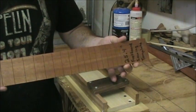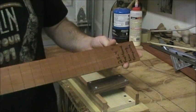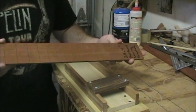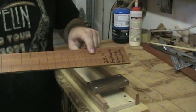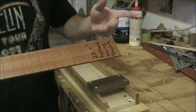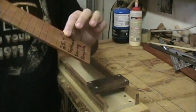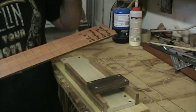If the index board is wrong, every other board made from it is wrong, so take the time to make this right. I definitely recommend buying a store-bought pre-slotted board the first time. Measuring things out yourself - yeah, you'll probably get it right eventually, but if the sawing is off that ruins all your efforts. You usually don't find out something is off until you're up around fret 15 or 18 and then ruin the entire project - that's Murphy's law. Always label your templates clearly; right now I can see this is a 25.4-inch scale template.